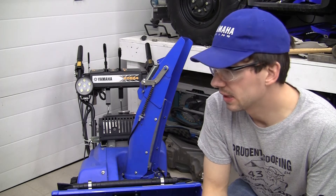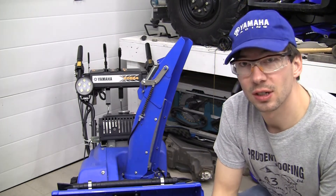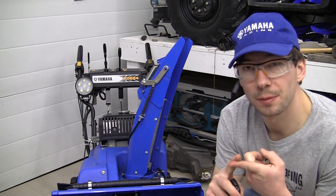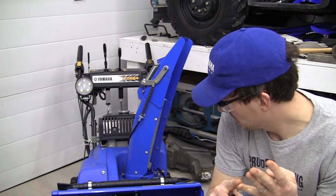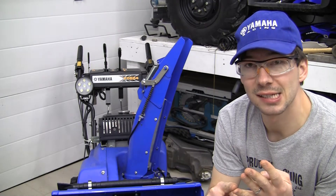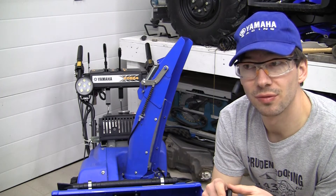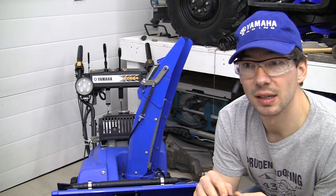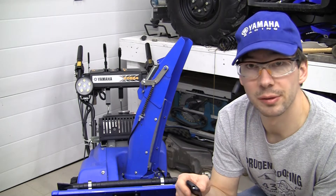Luke Galan here from the YT-624EG maintenance series. Today we're going to look at where the shear pins are on the snowblower, what they're called, what the shear pin kit contains, and how to get the shear pins out. Part of what I read on a forum is that these shear pins can tend to get seized into place over many years. I haven't broken one yet in four years of service, so it's a good idea to take them all out and grease them.